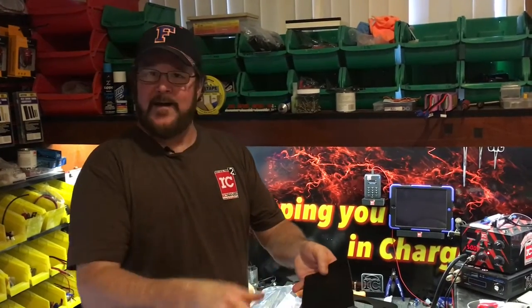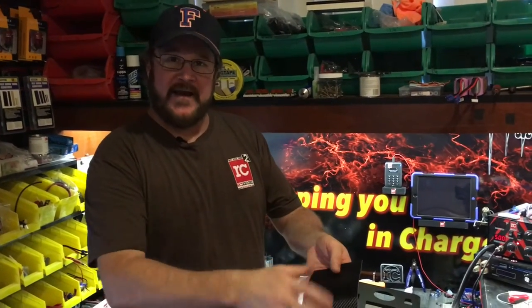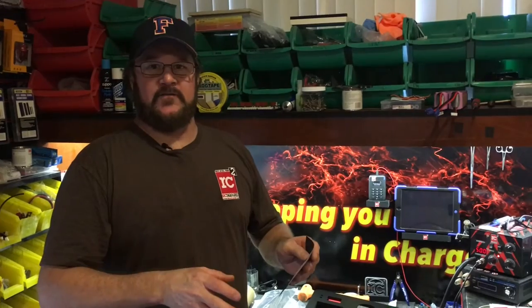Your deck's going to be facing up. Take the backer that you peeled off, lay it on top, and then you can squeegee it out — that keeps from marring up the vinyl. You can really damage the vinyl, and when you flip it back over, if you see a bubble, don't try to push the bubble down; try to chase the bubble to an opening. If you have to, you can pop that vinyl and peel it back up and try to get it back on.